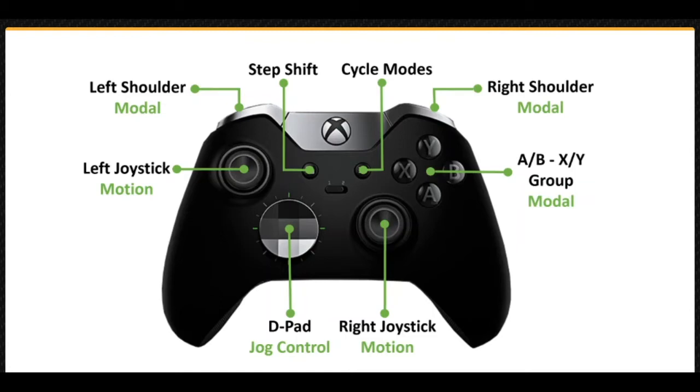The right joystick controls yaw, turning left and right, and vertical, dive and surface. Pushing forward dives the vehicle and pulling back surfaces it, similar to the way a pilot controls an aeroplane using the yoke. Leaning the joystick left yaws the vehicle to the left.